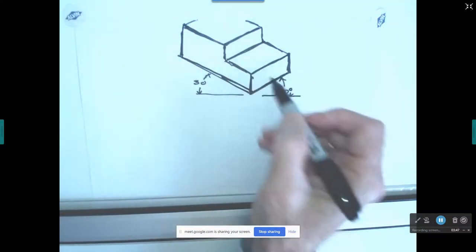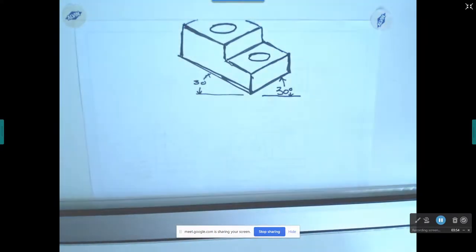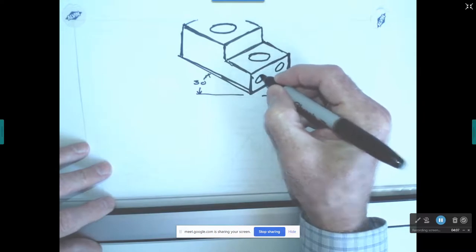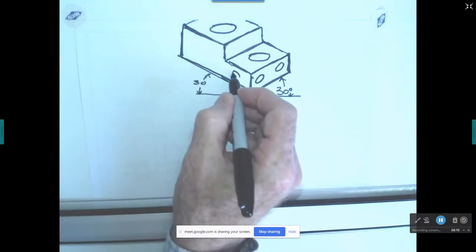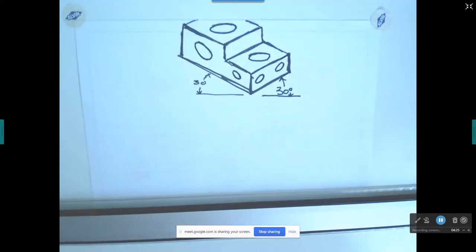Sometimes you're going to have holes added to those drawings. There are a couple of holes drilled down through my isometric drawing. If I had holes on the side plane, they would run at this angle. The ellipses that represent holes on different planes are oriented at different angles, and those are oriented correctly in this drawing. I'm going to explain how you do that and know where to put them.